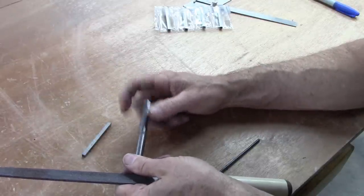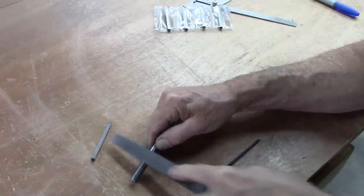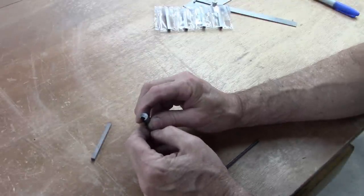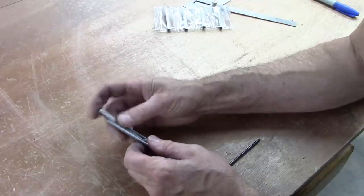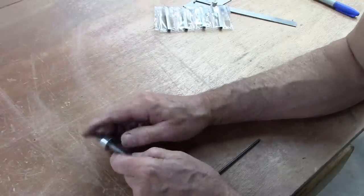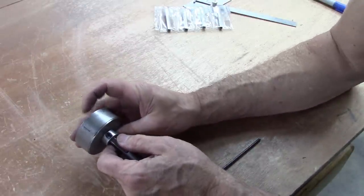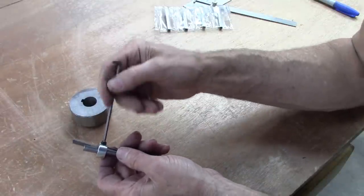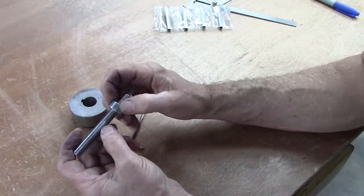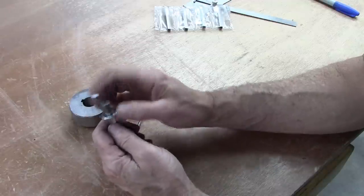I went through with the mill right there — there's a little burr right here. That mill just barely went through; I went 120 thousandths. So let's make that a hundred thousandths instead. Put the tool in there, bottom it out on the groove, put your lock collar on there. You can position the collar up here, but it's better to have it down here if you don't need the depth. See where I came through right there? You want to avoid that, so make it a hundred thousandths deep.